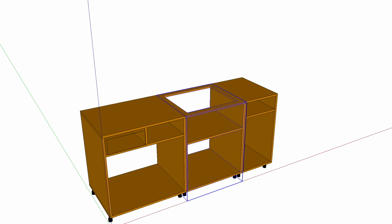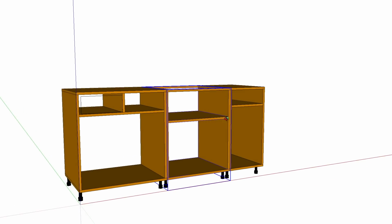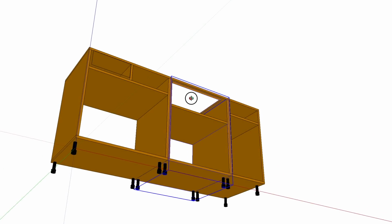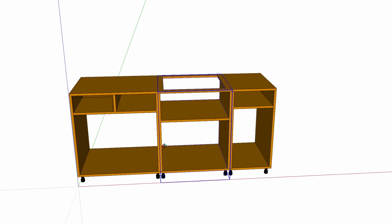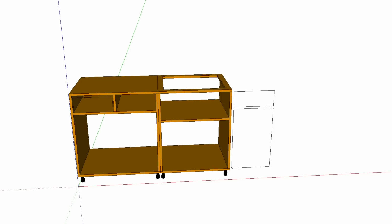And now again, we're just looking at the cabinet bases. So that's kind of an idea roughly what it takes to put these all together. And then of course we just have the cabinet levelers here on the bottom. We did not draw in the toe kicks. We can do that. So here's each base cabinet. We'll build these one at a time. There's our 30-inch base cabinet. Then we'll build the sink base, and those will get attached to the sides.